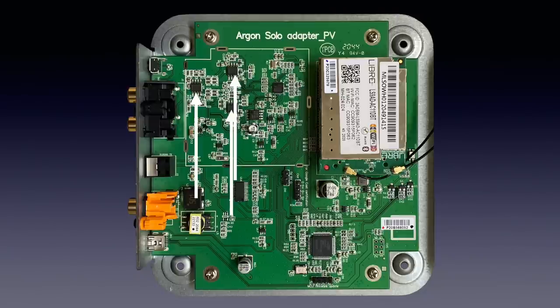Argon has chosen to limit the player to PCM at a maximum of 192 kHz sampling, which would probably cover 95% of the market or more and keeps it affordable. The DAC chip is capable of 384 kHz PCM and DSD, but the other components — like the digital audio transmitter — are not suited for sampling rates over 192 kHz. You're better off offering 192 kHz done well than 384 kHz done poorly. And let's be honest — how much music do you have at higher sampling rates or DSD?